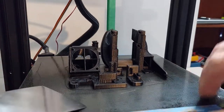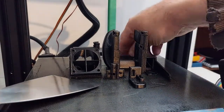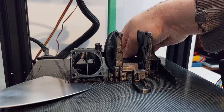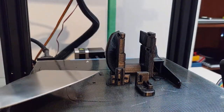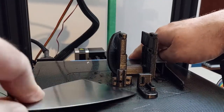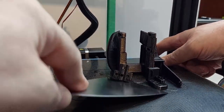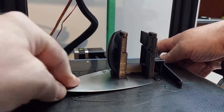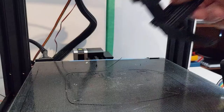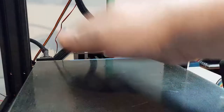Now that I've finished printing, they came out very good. I'm just going to remove them from my build plate. I actually flip my build plate over so I have the glass side, and I use a liquid adhesive as a separation barrier so I don't do any damage. But as you can see, it does stick quite well. So I'll just be removing these parts and then cleaning them up for post-processing.